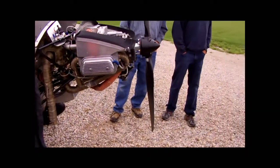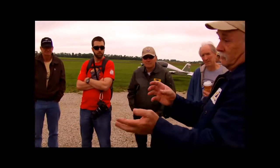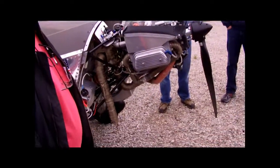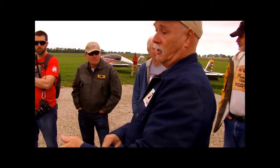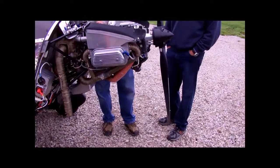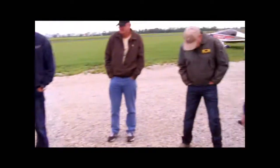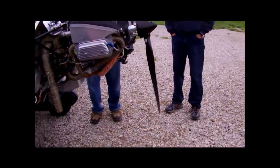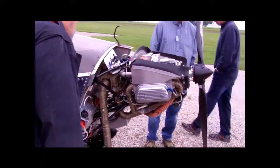Is the heating issue with the cowling? You get a lot of heat back in there — maybe ceramic coating on the lower section might help. I don't know that you even really need the heat wrap. The heat wrap mostly is just to keep the heat in the exhaust because you want the heat to charge the energy for the turbo. It probably stops a little bit of the radiant heat in the cowling, but once you stop and park, that thing is an oven anyway. Is the cowling too hot to touch? Oh yeah. I always wanted to make little doors on the top of the cowling to let the hot air out, and I might do that when I have to replace the cowling. I did put an extra blanket back there because it runs so close to the firewall — I was concerned it might have some effect inside the cabin, but so far I don't notice anything.